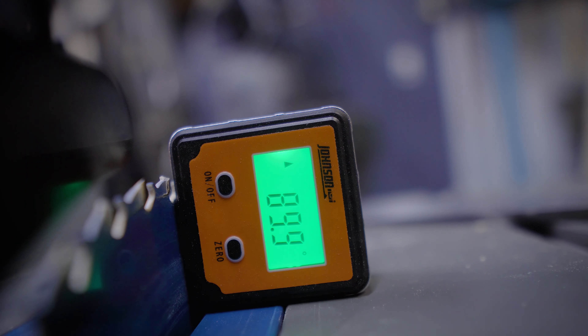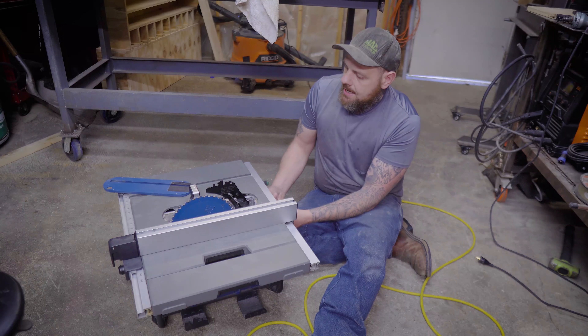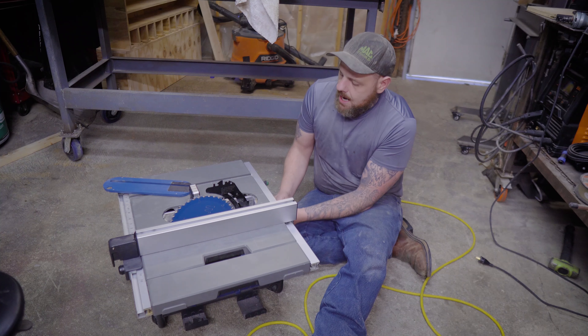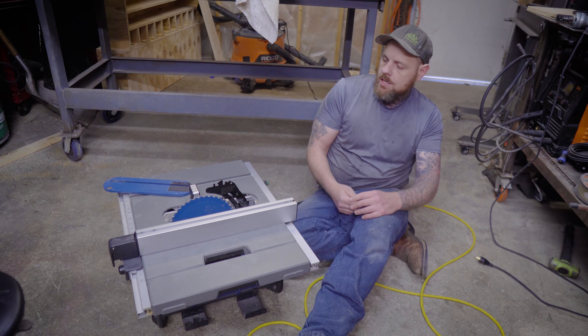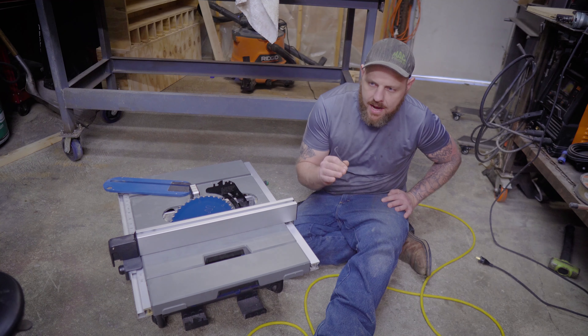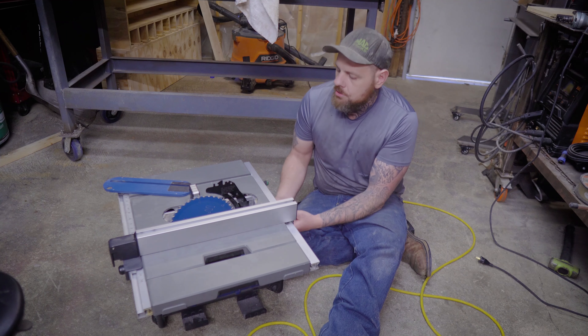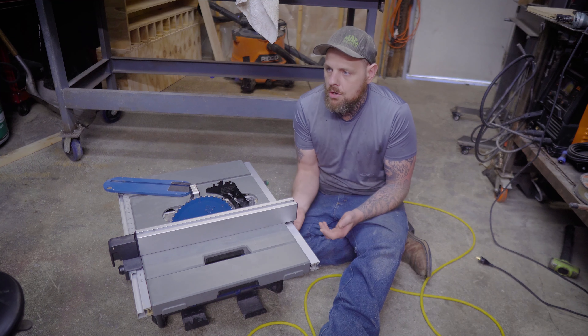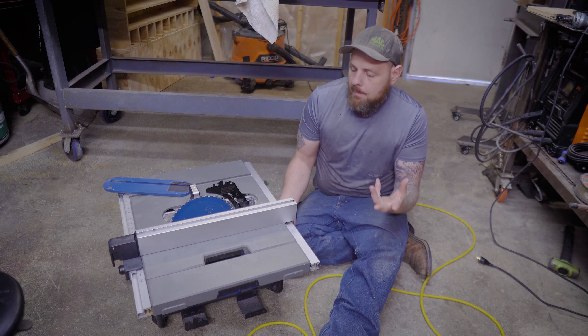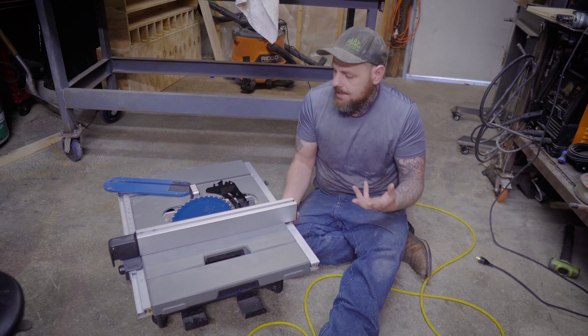You want to keep these bolts tight — don't have them completely loose or they'll rattle. Tighten them up and then get it close to 90 from there. When I first got this saw the angle was about 89.4 to 89.5, so I did have to adjust it a little bit. I want to get it as close to 90 as I can, and since I know how to do it I'm obviously going to do it. Right there — I got it 90 dead on.